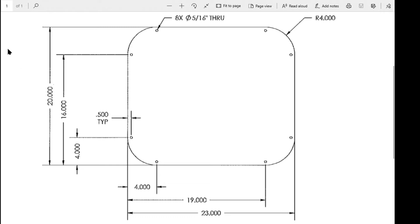This is the project that he needed. He needs to make 32 of these — it's a quarter-inch Lexan, basically 20 by 23 inches. He's got eight holes in them; they're 5/16ths through holes, located four inches from the corners. The corners are going to be cut out because there's a four-inch radius fillet. So: 20 by 23, four inches in, half-inch up to the center line.